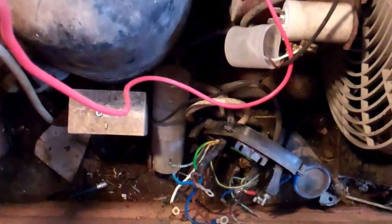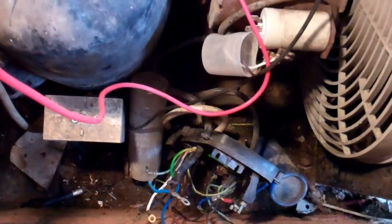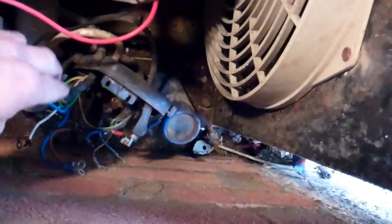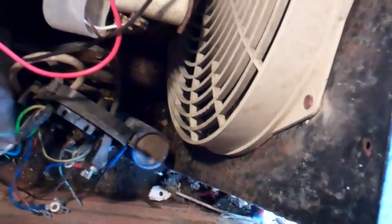Plus or minus 10%, so 22.5 to 27.5 would be fine, but 18.8 is quite a bit under. So if I was buying parts I'd probably change that. Even if I was just servicing it, I'd probably change it. So new start cap, new run cap, new relay - you might as well buy a new box. Because of the labour in swapping that box over and swapping the new parts in, you'd get the new box and your tails off. New box, new fan motor then.